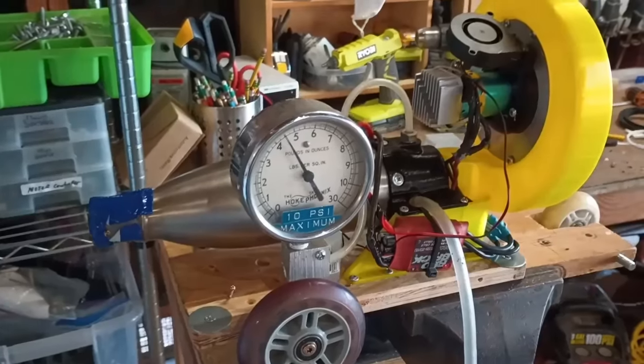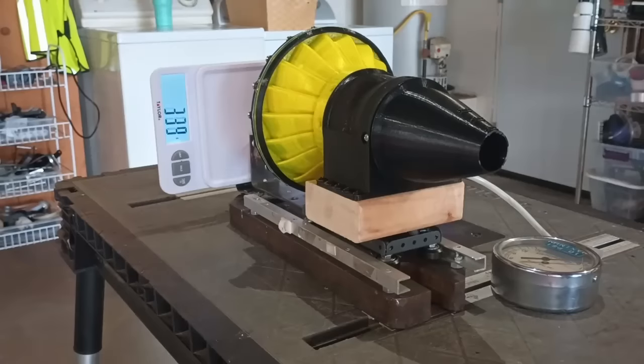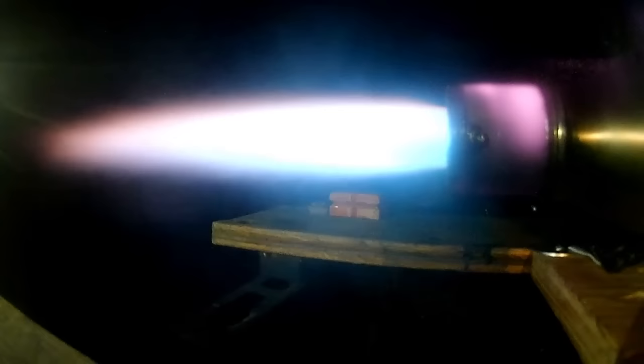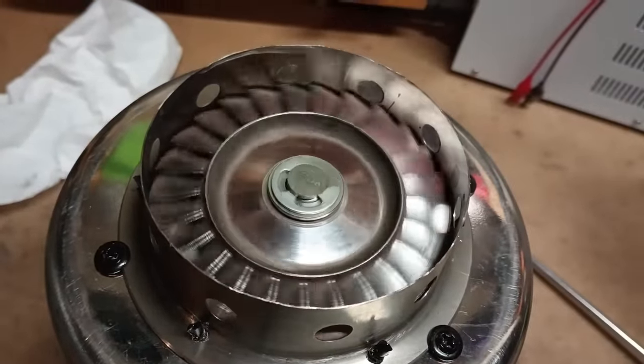I've worked on many electric compressors, but it was clear how much more power was needed to get any amount of usable thrust. After all, this is supposed to be a jet engine. I had a solution. By directly using the combustion exhaust itself to provide the power to the compressor, this was the very definition of a turbine jet engine.